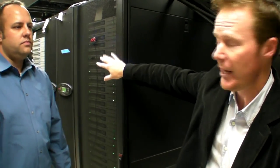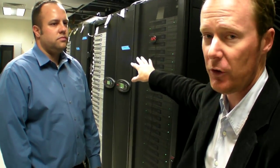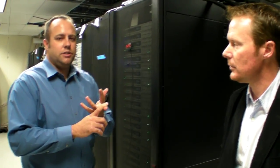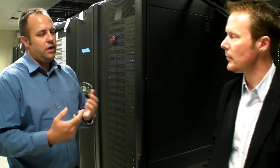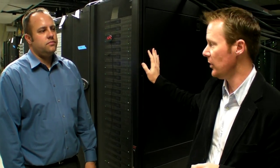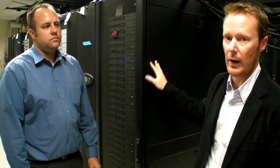The variable speed fans are notable. You can actually see the temperature sensors on the servers — those are part of the RC unit's system to regulate its output. The unit monitors the supply air temperature, rack inlet temperature, and return air temperature. It shows how much capacity each unit is using, allowing quick capacity planning decisions. The cooling is completely automatic — all cooling units operate independently of any human interaction, and as loads increase or decrease throughout the day, or new racks are rolled in, the system adjusts itself automatically.